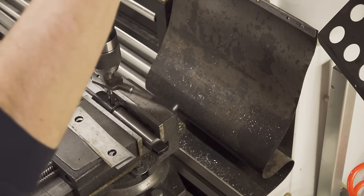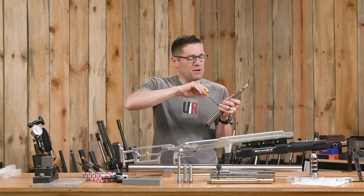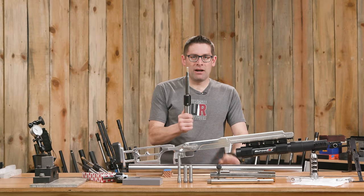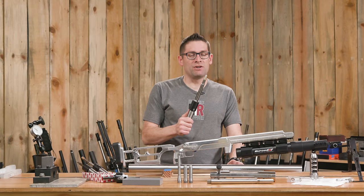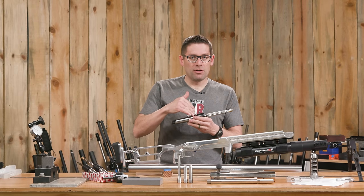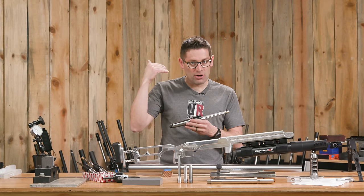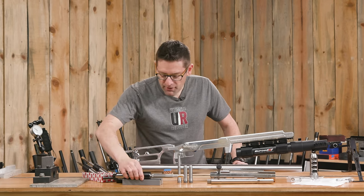I then drilled and tapped — this is 5/16ths-18. I know exactly where the reamer needs to be in terms of depth. I do a slight twisting of the reamer until I can feel the set screw hit the flat. Now I'm ready to go — we're going to be in perfect alignment. This is a do-or-die situation, going on faith, because there's no give in the reamer. When you're down on the flats with the set screw, it's either going to cut perfectly or it's going to snap off. That's where you have to be very sure of your lathe, very sure of your alignment, and very sure of your feed and speed.